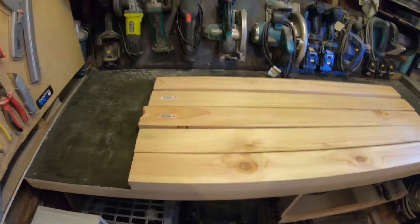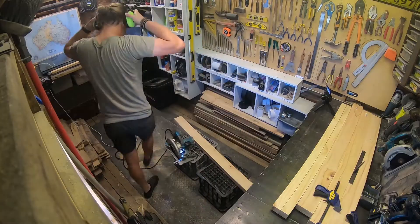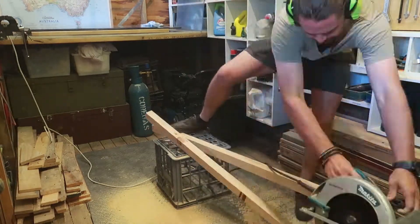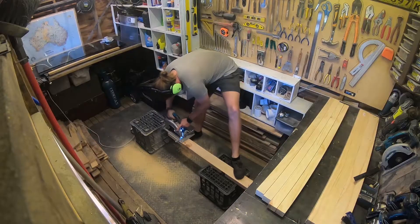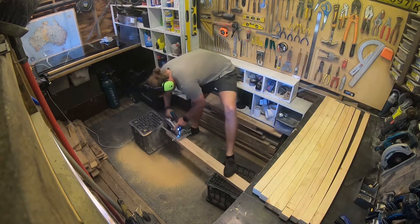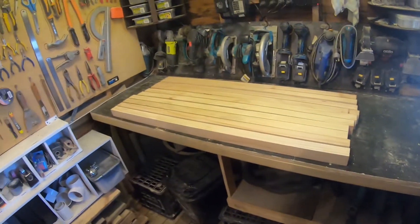Here are five lengths of raw pine that I've purchased. They're 90 by 45 mil and they're 1200 long. I'm going to need them to be 45 by 45. So before I get into this project I'm just going to cut them all straight down the middle in half. I've got a little attachment that I can put on my circular saw and that's going to act as a guard so that I can just run straight down the middle. I don't need to mark them out or anything and that's going to allow me to cut nice and straight and just make sure that I get them nice and even. So there we have it - ten lengths at 1200 long, now they're the right dimensions for this project.